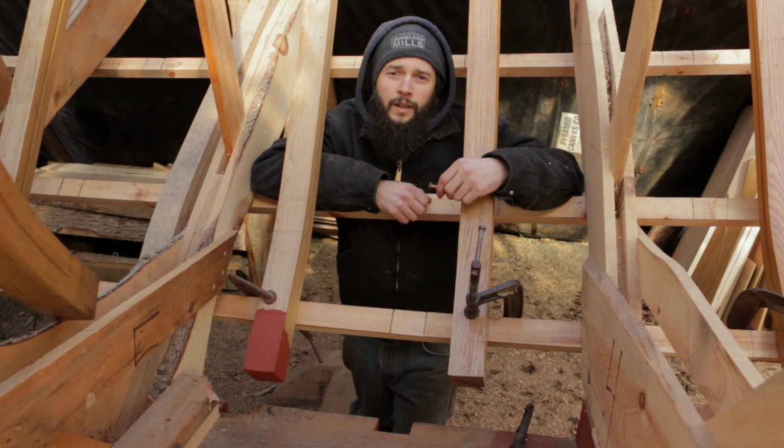We have a little more work on the stem and stern rabbets to do, and a little more steam bending coming up. Hopefully we'll have all that done by the new year and start hanging planks shortly in 2019, which will be really exciting, so stay tuned. Once we get the final quirks worked out of the rivet machine and start cranking the rivets out, we have everything we need to see us through planking, which should keep us busy right through the winter.